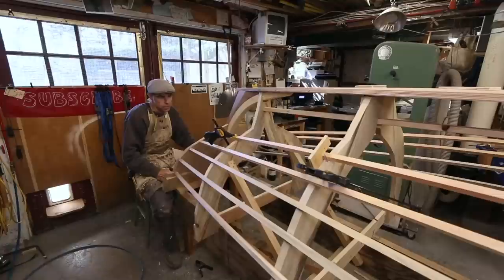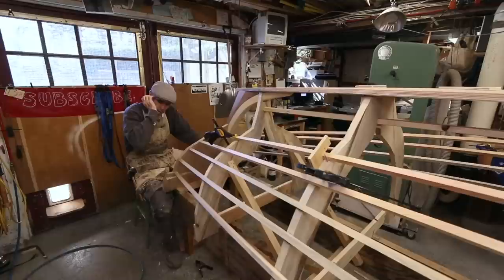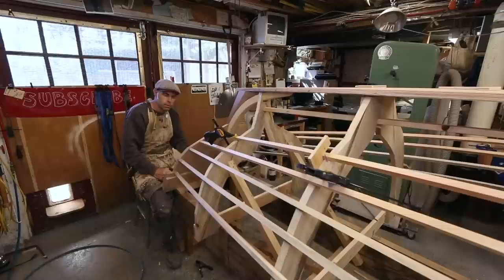So that's something that's happening right here where I'm coming around the corner. I've had to play around with these plank lines. And in fact, full disclosure, when I was designing this transom, I think I screwed up a little bit. I was designing to the outside of the plank. And this was the one time I probably should have designed to the inside of the plank, and I would have gotten more predictable results. Because as I got here, I suddenly realized, oh, wait a minute, all these plank lines I was working to are not quite correct. And so I had to think about how these planks overlap down here in a way that I hadn't quite mentally worked out, that geometry in terms of plank spacing.